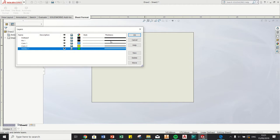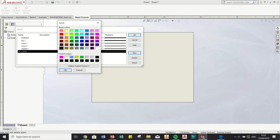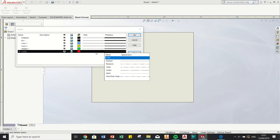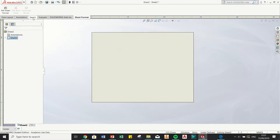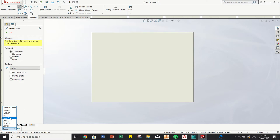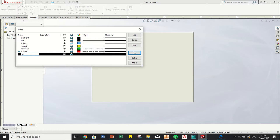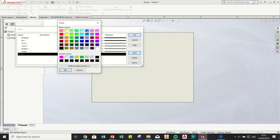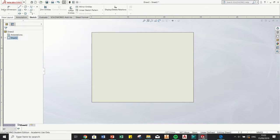You want similar layers to this setup. The line thickness for a finish line is 0.7 and I pick roughly 0.35 for other layers. I'll add a center line layer just to show you how - I usually make it red. Then for the xy construction layer I usually make that dark blue, set to 0.7 and continuous line.